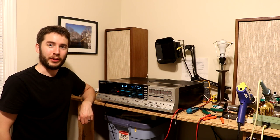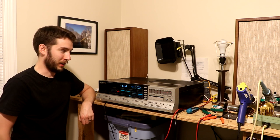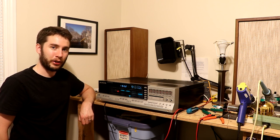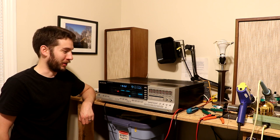So there it is — the Kenwood KR-1000. It's working now and I'm pretty excited that it's going to be a little bit more reliable and a little bit safer, because I adjusted the amplifier and got the thermal compound replaced so that there's better heat transfer among the outputs and it'll make it last longer. The only downside is it's not going to run as warm as it used to, so the cat might not be so happy about its return after all.